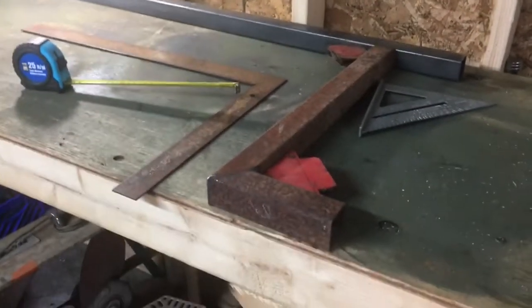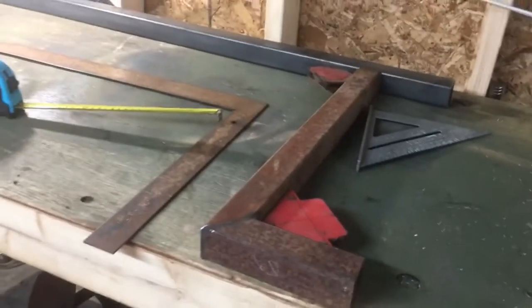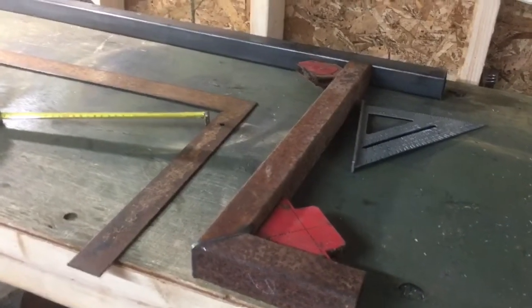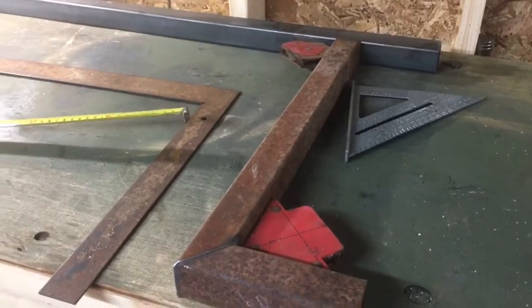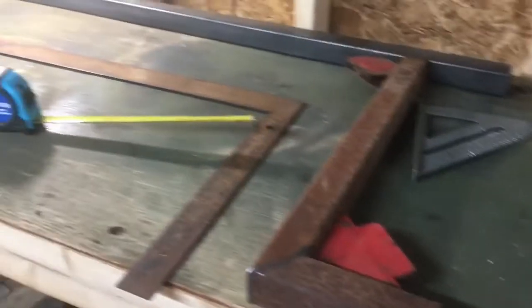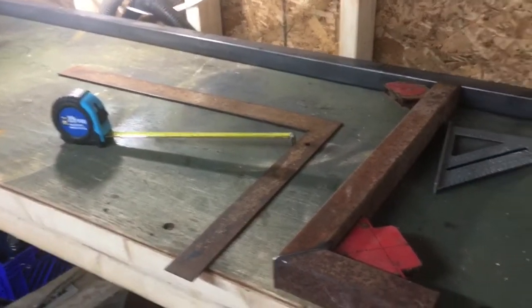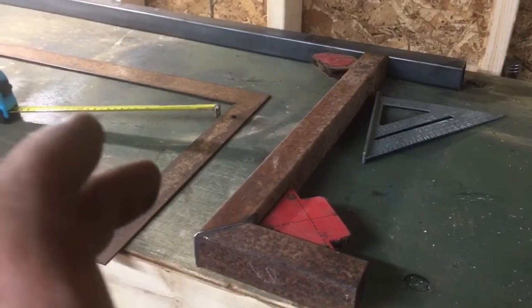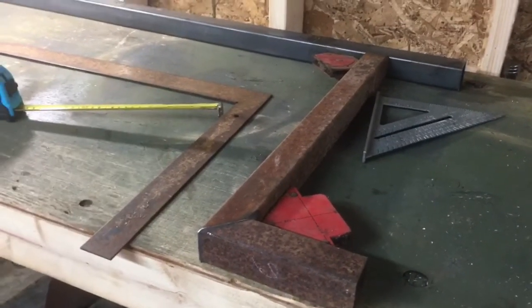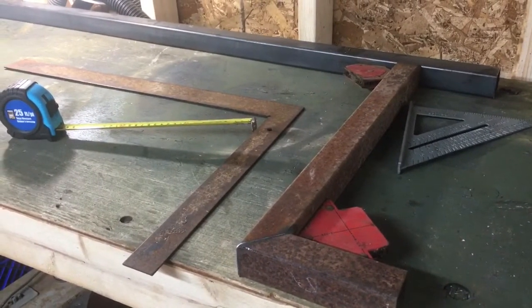So we've got all of our pieces cut. We've ground all of the edges to make sure that we're gonna get a nice clean weld out of them. Now this is a very important step — squaring things up before we weld. We're sitting here on a bench getting ready to weld them, and making sure everything is square is essential. Measure multiple times, square them all up, and then we'll tack it together. Tacking is just a very small piece of weld that holds it together — kind of glues it in place. Then we'll go back over the whole thing after we're confident that it's the way we want it, and weld it solid.